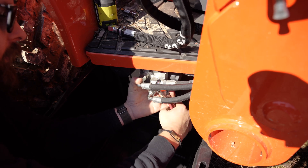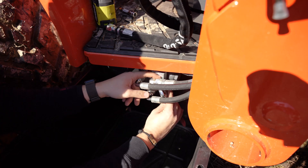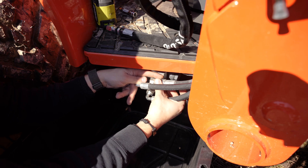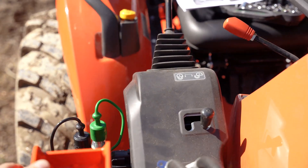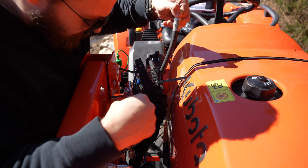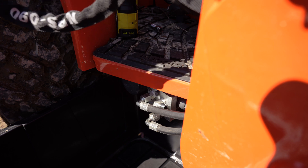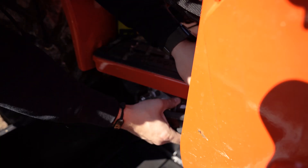This part's a little hard to get into — it's a tight squeeze, but we can maneuver through it. Here's the loader control; we've got to take off this valve down here. Next, we're going to take the hydraulic hose from port P, which is marked under the third function valve, and connect it to the tractor's outlet block here. This is the one that's a little tight to get into.